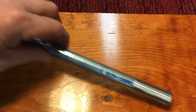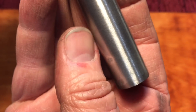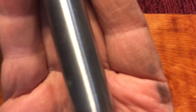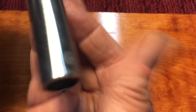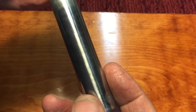Now to do a demonstration — each side of these pipes I did with about a 320 grit sandpaper. You can see the little micro grooves in here, there's no shine really to speak of, but you can see what it looks like with a 320 grit. It's nice — most tools you would say that looks good — but when you look close, it's going to be hard to get a polish on this even with buffing. On the other side, I did it with up to about a 400 or 420 sandpaper. It's much, much smoother. You could feel it — it feels very nice and smooth. It's got a little bit of a shine to it; you can see my finger reflection. So we're going to take these to the buffing machine and see what each one looks like when they're buffed out.